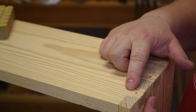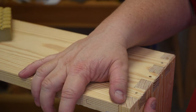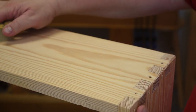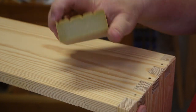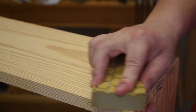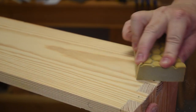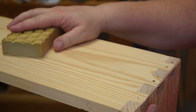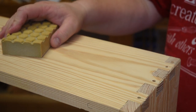In the end, take one of these sanding pads — not too coarse — and just scuff everything up to even it out in case you have any track lines. Now if you are concerned with gaps in your joinery, this is the time to take a little bit of that hide glue, smoosh it into the gaps, and work it in with some sandpaper — something sacrificial because it'll get gummed up. It creates a slurry that fills the cracks, and then you just sand or plane off the dried hide glue. This is just a toolbox for me so I'm not too concerned about it.